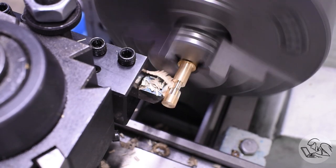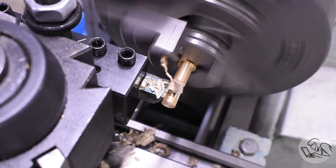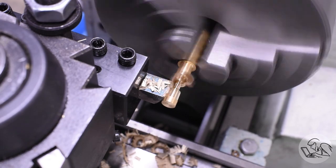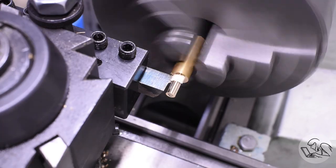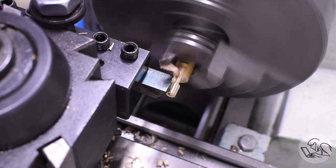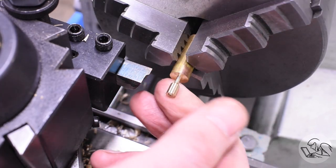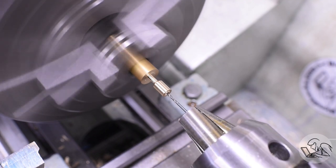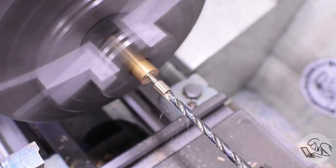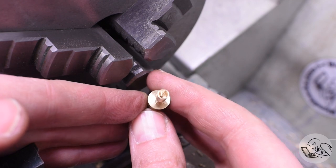I've got a piece of round stock and I'm going to plunge in with the tool. The round stock is larger diameter than the final oil cups but that doesn't matter — I can just go in until the small diameter is correct and the outer diameter should also be correct. One thing I wasn't sure about is whether the thin stem is going to be strong enough to hold the part as we turn it, so this is a good test for that. I'm trying to do it this way so I can do the whole part in one setup, doing all the drilling on the big end of the cup. But that didn't work. However, most of the cutting forces were right at the end when both diameters are being cut, so I did a test where I turned the larger diameter down first, then pushed the form tool in until that side was just touching the work, and that worked great. I'm also drilling out my test part to make sure the stem can hold up to drilling forces — and indeed that worked really well. Drilling the small drain hole was tricky because it's a very tiny, very deep hole, so I'm going to do that differently on the next part.